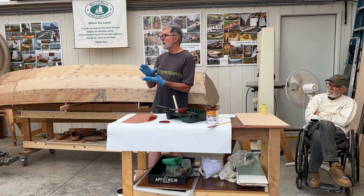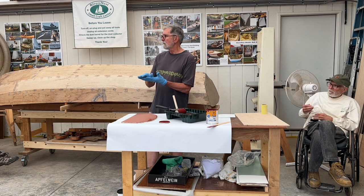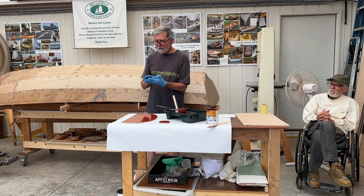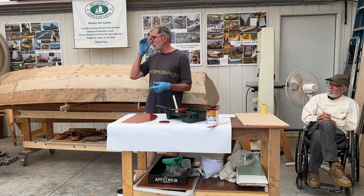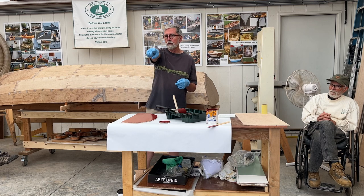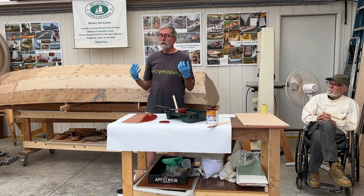Painting over epoxy — the key is to get an absolutely flat surface. What you want to do is sand out that epoxy. Again, to give it some tooth. If you're going to sand a boat, you need to get it down to where you see no gloss.